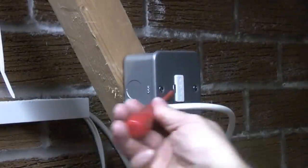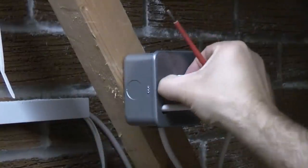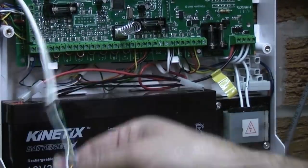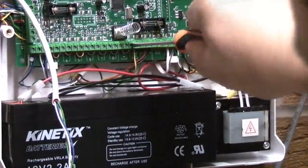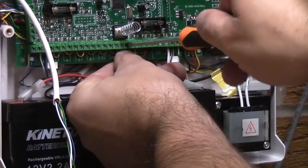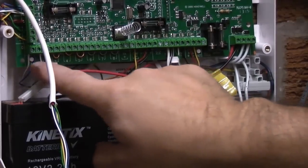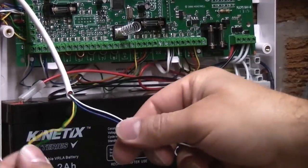I'm now going to remove the fuse for the alarm — that will ensure there's no mains voltage in the actual alarm panel. I've fed the cable into the alarm panel already. We only need to use four cores for a PA button so I've snipped two cores off. The PA actually wires into this terminal here, so we need to remove the link at the bottom and pull it out. Looking at the two zones wired into this panel, we've used blue and white, so we're going to use blue and white for the PA and green and yellow for the tamper.